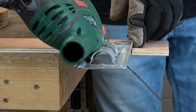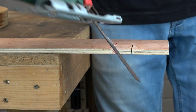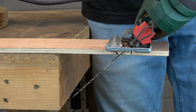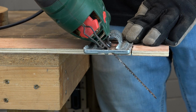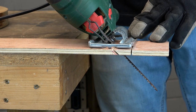So I will cut a 45-degree slot until I reach around this point. Then I cut the slot like this, but the cutting blade must look to the opening of the slot, so it is tilted to the wrong side. I have to change the inclination of the cutting blade to the other side. And now it enters perfectly in the slot with the blade teeth looking to the front of the jig, and it is tilted to the correct side.